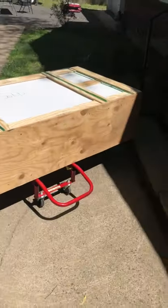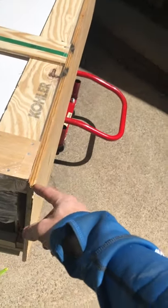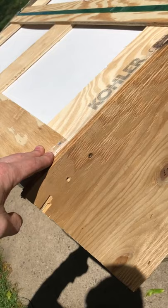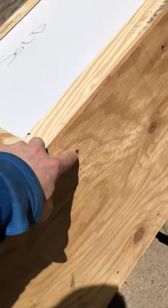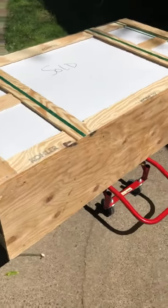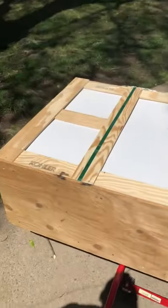Continuing with my upstairs renovation, I need to get the bathtub upstairs. I bought a Kohler Villager and this thing weighs, according to the specs, 317 pounds. What I've done so far is take the tub, cut a piece of half-inch plywood down to 63 inches by 16 inches, and fastened it to the box frame with some one-and-a-quarter-inch construction screws. This is going to stiffen the whole thing up, and I'm going to try to slide it up the stairs on some plywood ramps using a trailer winch I just bought at Lowe's for $20 on clearance.